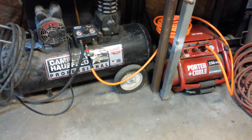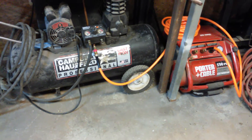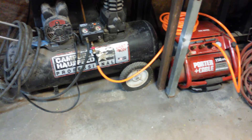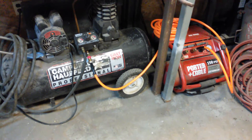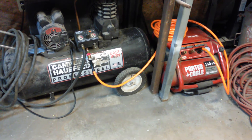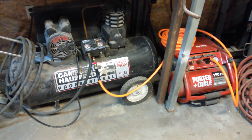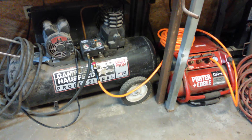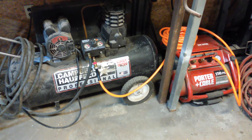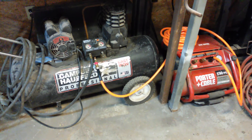Together I've got a little over 12 CFM at 90 PSI, and I also picked up from 26 gallons capacity by adding in another four and a half gallons, so I'm at thirty and a half gallons of compressed air. It's worked out really, really well and I don't have any shortage of air pressure or volume. It's a great setup and does as well as a big compressor.